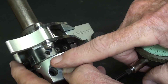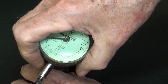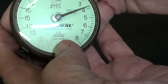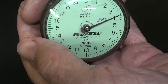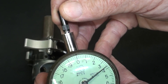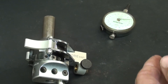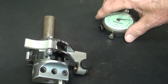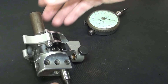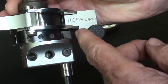I'm showing you this at the bench because I think it's easier than attempting to show you after it's mounted on the machine. This comes right up against that surface right there, and you still have access to these set screws and to the dial. Notice that the indicator that came with this reads in diameter — two tenths of a thousandth. So it's a very accurate and nice federal indicator, top of the line. There is also a set of directions that came with it. In there it mentions that you cannot use it if you have more than a quarter inch of the slide sticking out.